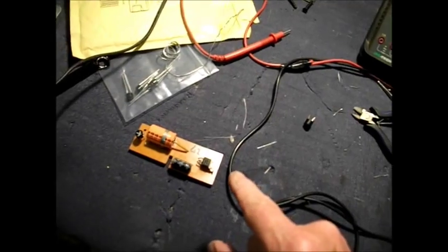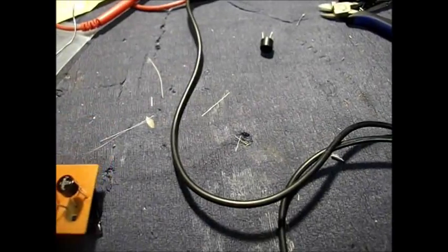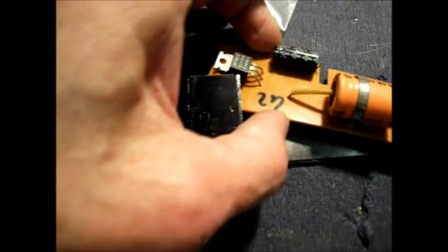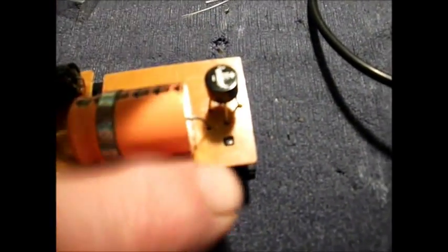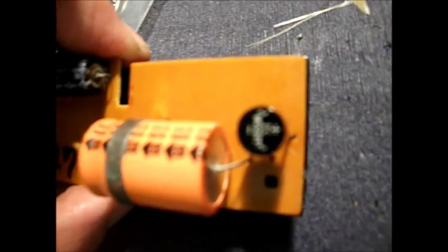Right. Put the heatsink on. He says, "Where is it?" Anyway, I'll get that fired up from somewhere, and we'll put that on heatsink. Now we're just going to put the board back on here and bring this over here. This has got to be pushed over a little post here. So there we are. It looks as if that was the fault, the regulator, the rectifier.